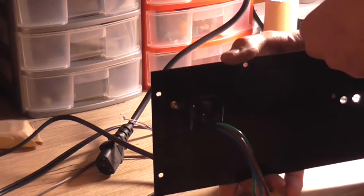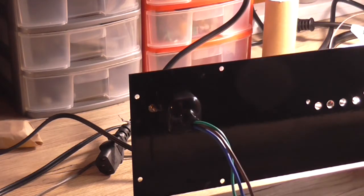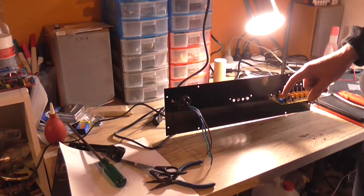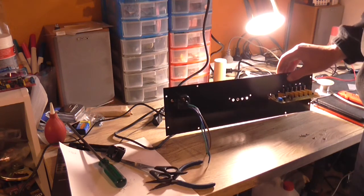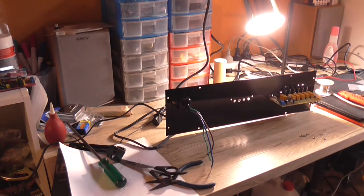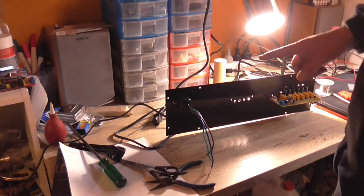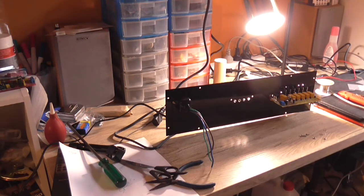Perfect. So now, all I need to do is mount the speaker connector, and then we're pretty close to actually mounting it on the back. However, I did think about changing this 220 microfarad capacitor here for the turn-on delay for the subwoofer relay to a 330 16 volt, because that comes on before the main relay comes on, so it's worth a thought.